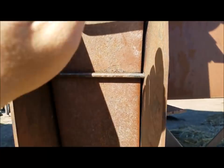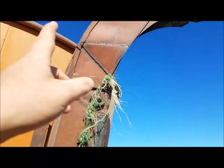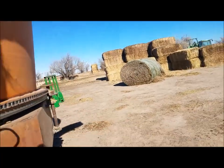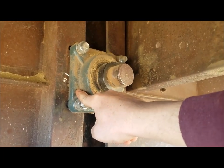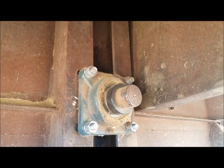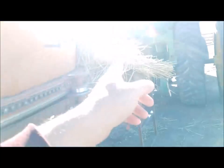Pretty sure somebody just cut a hole through it and put a pin through it. The chute — you can see mine's pretty worn out; I hit it with a square bale. Most newer ones are taller now and have a hydraulic cylinder. All these bearings need to be replaced — I have all the bearings now. There are three main bearings: one on each side and one up at the PTO. I just replaced the one that was no longer taking grease; they're a standard two-inch bearing.